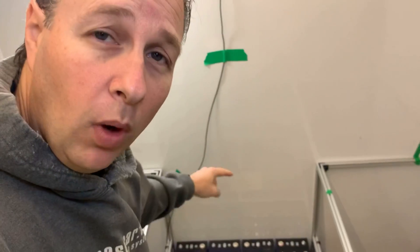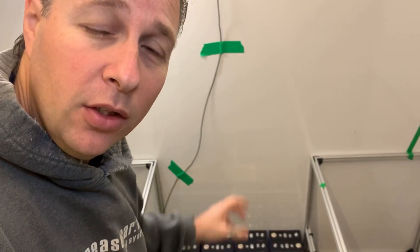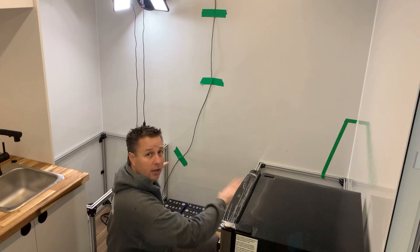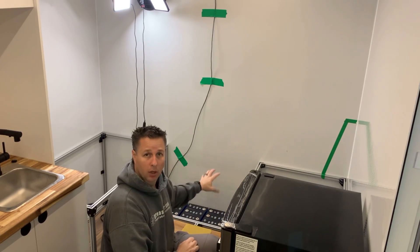Your next question might be: why do I leave gaps in between each of the rows of three? Well, this type of lithium iron phosphate cell can actually swell when it gets charged, and that reduces capacity, so I need to constrain these cells to stop them from swelling. That means inside this box we need to form something that can contain the batteries.